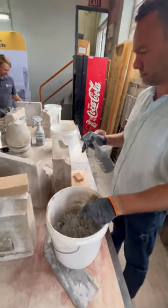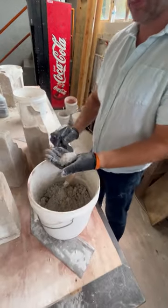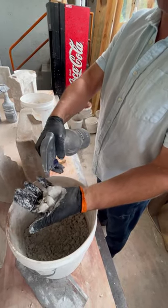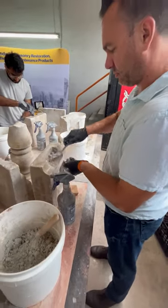So we're gonna install some water on the patch area. Then we're gonna grab some material and wet it up in our hand. This is the peanut butter coat step. Give it a little more. And now spread that around with your trowel like butter. It'll almost become paint, where it's hard to remove. It's like really wet plastic.